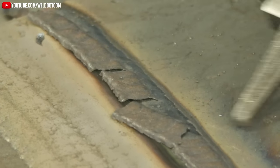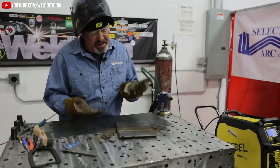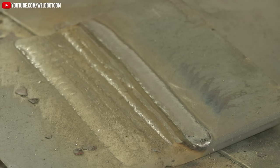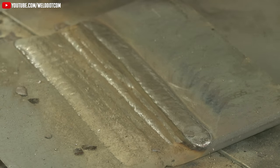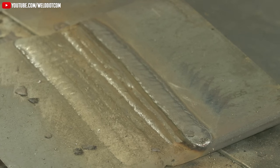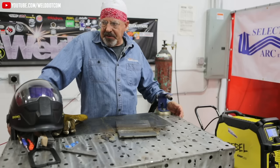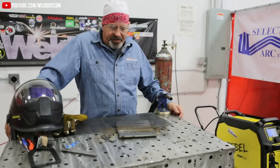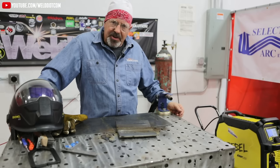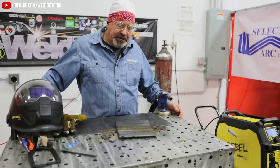I'm not seeing any adverse effects — no wormhole porosity — as long as I keep my electrical stick-out the same. So find that baseline of where the wire is supposed to run, and run some straight-line beads. Play with your settings — a little at a time in voltage, a little in wire feed speed. All these machines run different, so find that spot where it's nice and smooth, not throwing out a lot of hard buckshot, and the edges are wetting in nice. This was meant to be an introductory video for those getting into running dual shield. We are running the SelectArc 730 045 — it runs extremely well. Please hit us in the comments if you have questions, check us out on Facebook and Instagram, hit that like button, subscribe to the channel, and thanks for watching Weld.com.